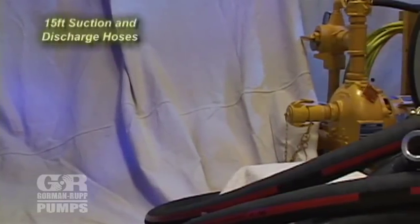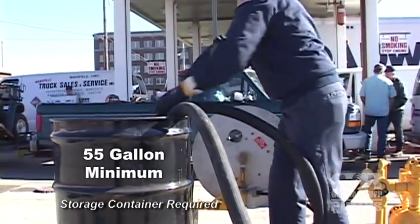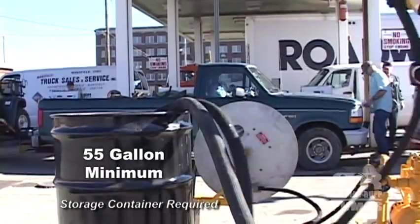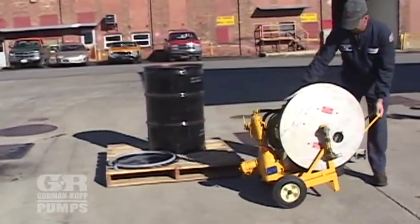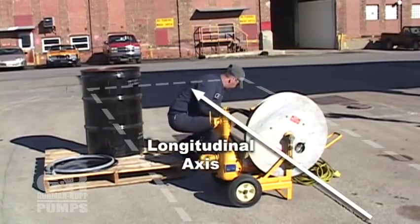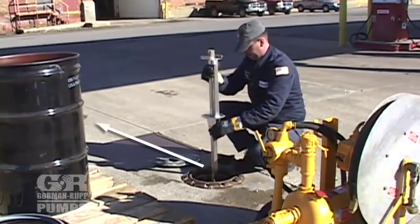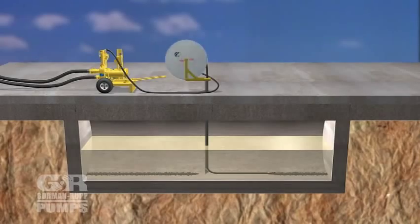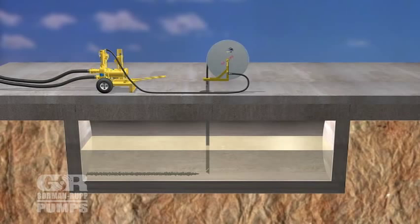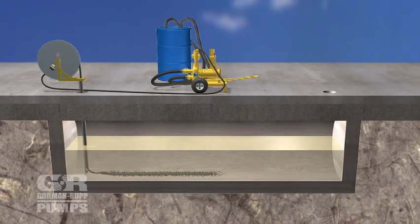The tank cleaner unit is provided with 15 feet of suction and discharge hose. An appropriate storage container is required to serve as a holding tank for extracted contaminants. Mounted on wheels, the tank cleaner is easily positioned next to the fill port of the underground tank. At this point, it is extremely important to determine the longitudinal axis of the tank. The standpipe can then be carefully lowered into the fill port with the bottom opening facing the opposite end of the tank. If the fill port is located at the center of the tank, two passes — one in each direction — will be required. Some large tanks may have two fill ports, and cleaning from both ends will ensure the removal of contaminants.